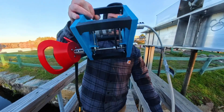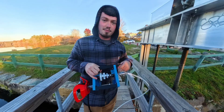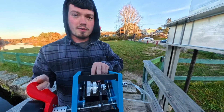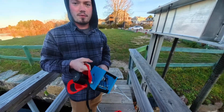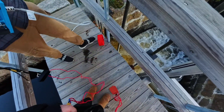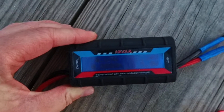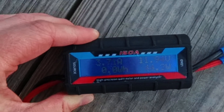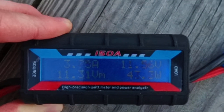We got 20 watts off our smallest pulley, so it's not a bad start. Hopefully we can see more power, but we might not actually max it out today. As long as we break that record, we'll have something to come back to. We've now got it hooked up to the 62 pulley, which will give us a 3 to 1 increase on motor speed. We should see a little increase on our 20 watts from the floor.